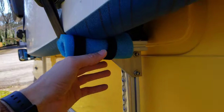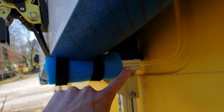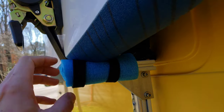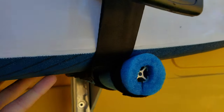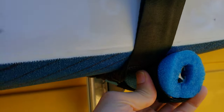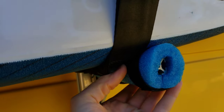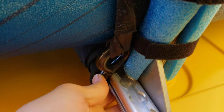Looking further up here on the crossbar, I have this angle bracket attached into the extrusion, and I just have a short length of 8020 extrusion with some foam wrapped around it to protect the paddleboard. I think I'm going to get a slightly higher density foam because this is just a pool noodle and I noticed it crushed down quite a bit. This hook in this case is big enough to just go around the 8020 extrusion. In other cases I can also put a quick release in here to attach the hook into.